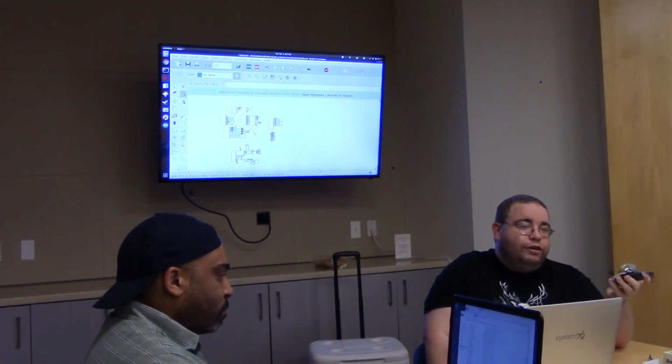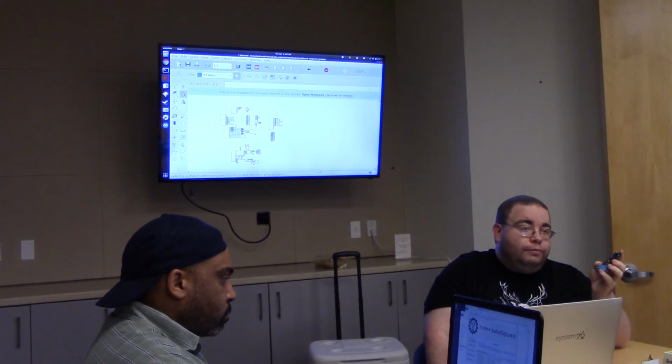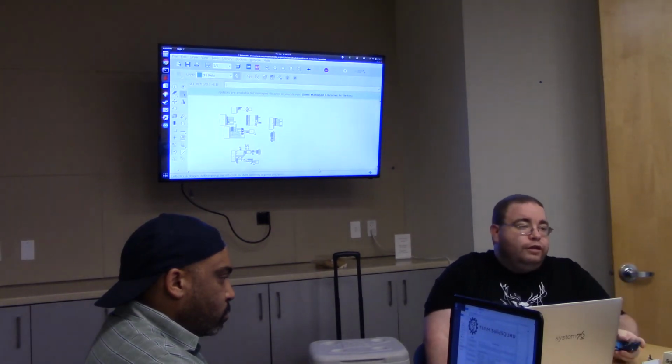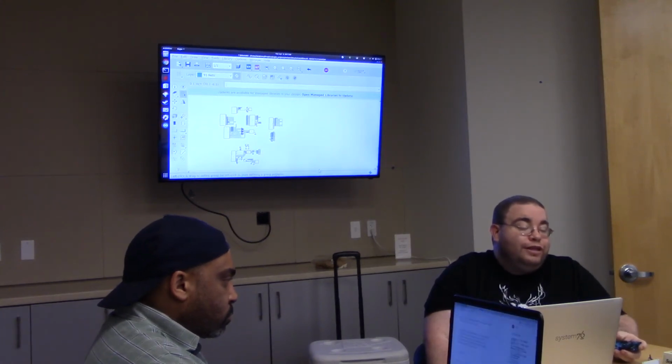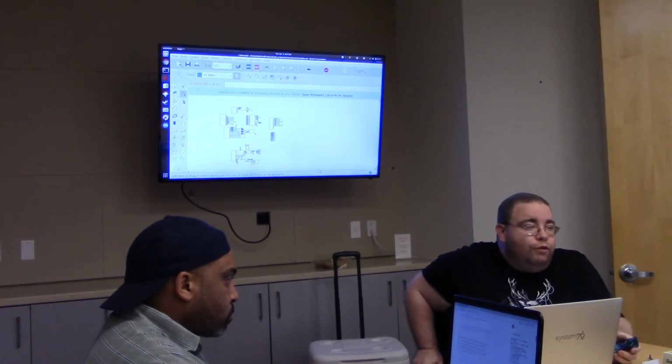The modes that I would like to target: I'd like to have 320 by 240, because I can't do higher than 640 by 480 because of the clock and because of the VGA signal. If you double the pixels on that, you get 320 by 240, which has a couple of benefits. It fits nicely in the space of RAM. It looks pretty good to me, at least, because it's the kind of graphics that were in games when I was a kid. VGA 320 by 200 was all the rage. That's what all DOS games look like.